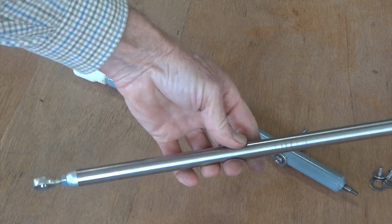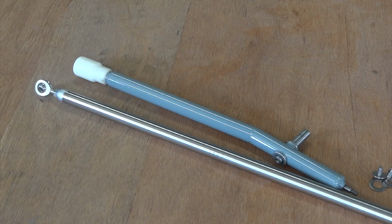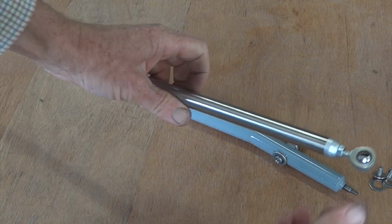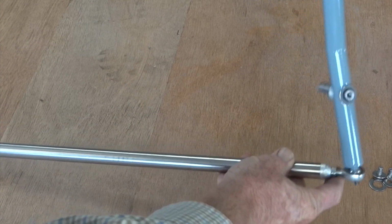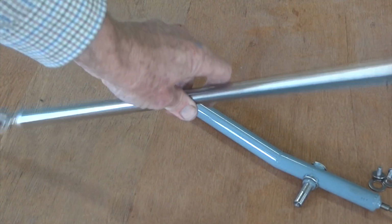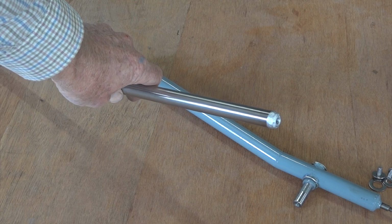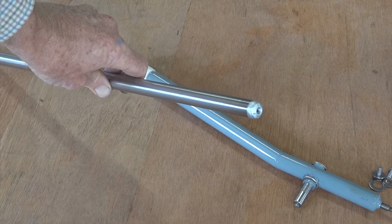And to get to the gearbox, a little straight bit of tube, that's actually a bit of stainless steel tubing that used to pump milk around the dairy on the farm here, but far better used doing this. That end, little M6 joint that goes on there, and the other end, to go onto the motorbike end of the show, needs a left-hand thread, but not having a left-hand M6 thread, it's got a left-hand nut welded into there.